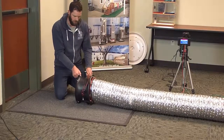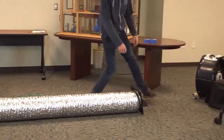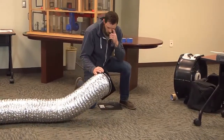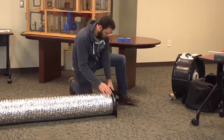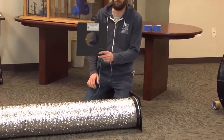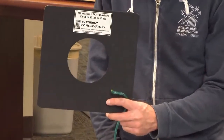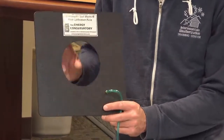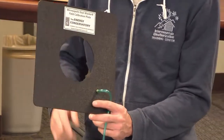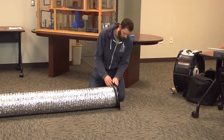As far as the other end of it, we've got our standard square piece that comes with your duct blaster. The other part of this is we have a flow calibration plate from the Energy Conservatory. This has a known dimension that under 25 pascals has a specified range of flow that will go through it under 25 pascals. You've got to have this calibration plate for it to work.